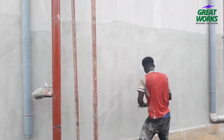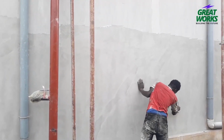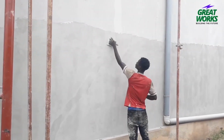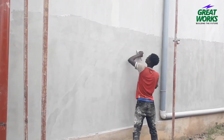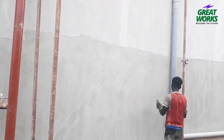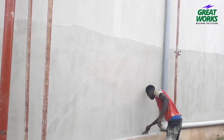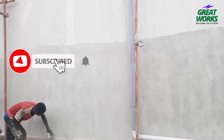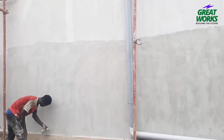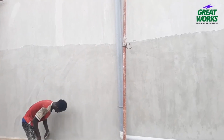Additional tips that can help you achieve better results include: 1. If the crack is wider than half inch, it may be necessary to use a crack stitching kit to reinforce the wall before repairing the crack. 2. If the crack is located in a high traffic area, you may want to use a higher quality patching compound to repair the wall. 3. If you are unsure of how to repair a crack in your wall, it is always best to consult a professional that can help you in that situation to get a perfect result.